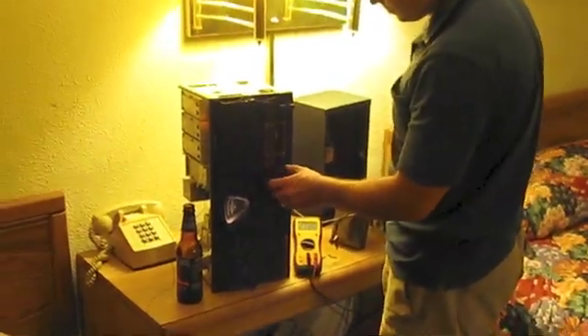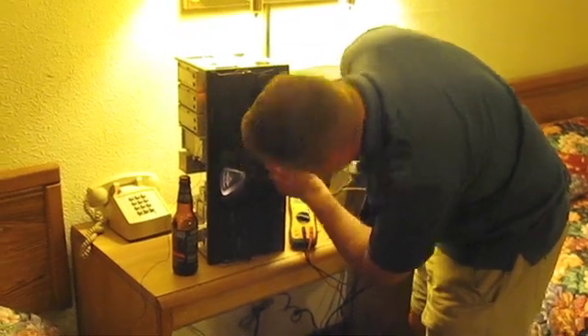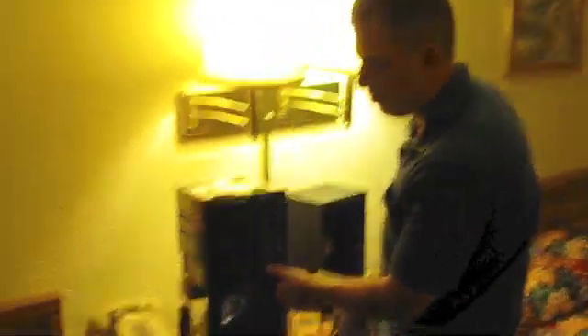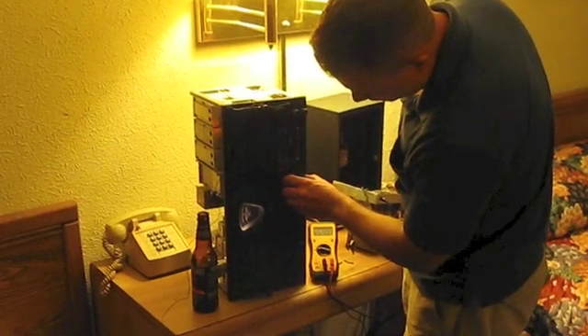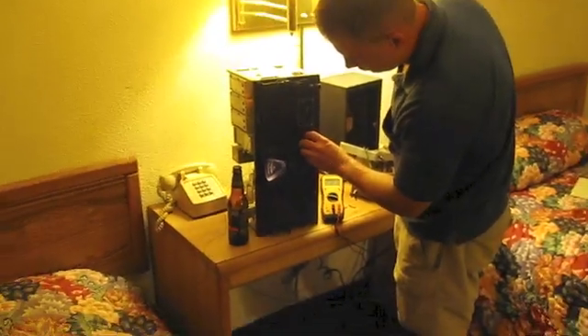I hear some stuff in the speaker. That is a shortwave station — we're in between 9.9 and 10 megacycles. With this crappy 2-foot piece of wire hooked to it, we're going to tune in WWV from Fort Collins, Colorado at 10 megahertz AM and see how it comes in. There we go. How's the alignment? I'd say it works. I'd say we got a runner.